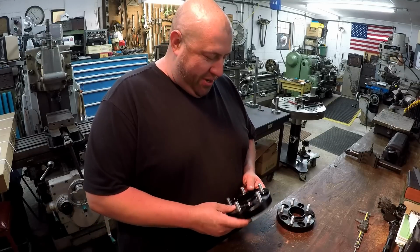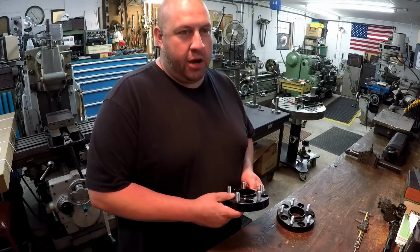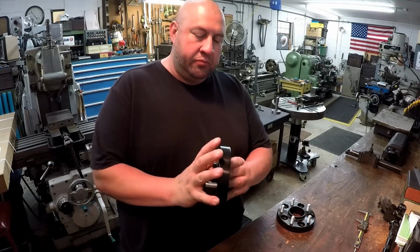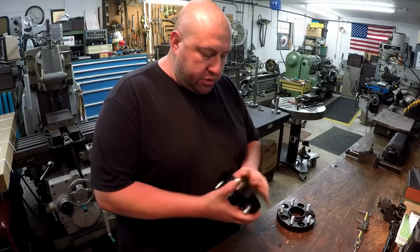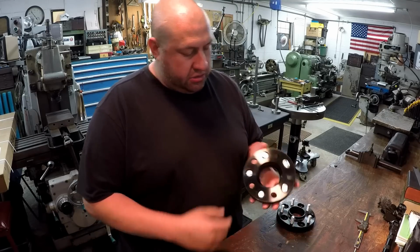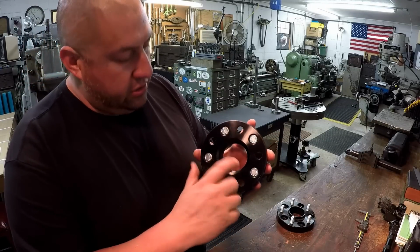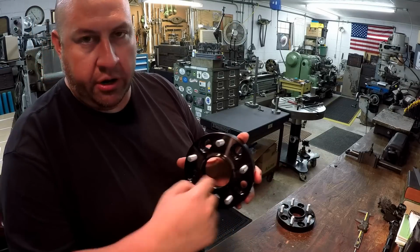I don't know. But evidently, what's happening is probably the offset is wrong. It's probably a car wheel and his offset's wrong. So he's having to space the hub out a little bit so that the rim will fit on the trailer. So it's a pretty simple, quick operation. All it needs is on this back side right here, this diameter. He says if you'll just bore it out, whatever this diameter is here, you see it kind of steps down and you have a smaller diameter here.